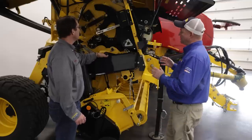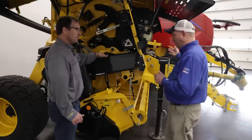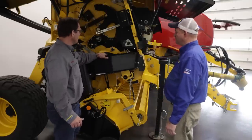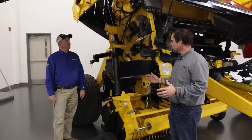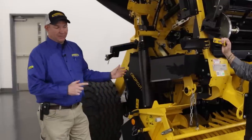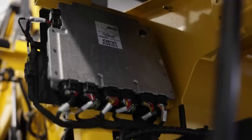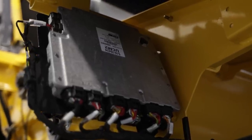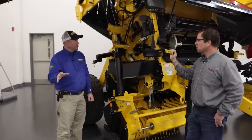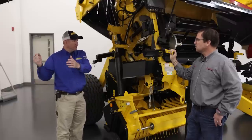It's all about taking the stress off one side of the baler — instead of having to send power across from the left-hand side all the way to the right-hand side through the rolls, we're able to split it out at the front of the baler. To control this baler from the cab of the tractor, this is an ISOBUS baler. However, you do not have to have an ISOBUS tractor to operate it. You can watch the baler function through the display monitor of the tractor, or even have a second display for tractor functions and baler functions separately.